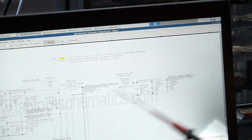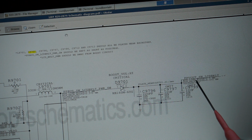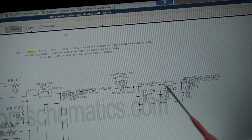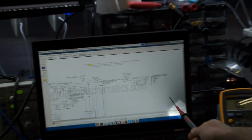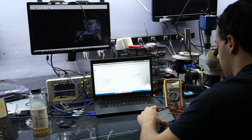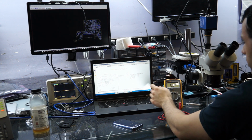Right over here, you'll see PPV OUT, SW, LCD backlight. These are the capacitors on it, and you can also measure it on the LVDS connector. As you can see, I tied a couple of the pins of the LVDS connector together, because on this board, those pins from the LVDS connector are the same thing anyway. It also makes it easier if I put a nice amount of solder on there to do this measurement.